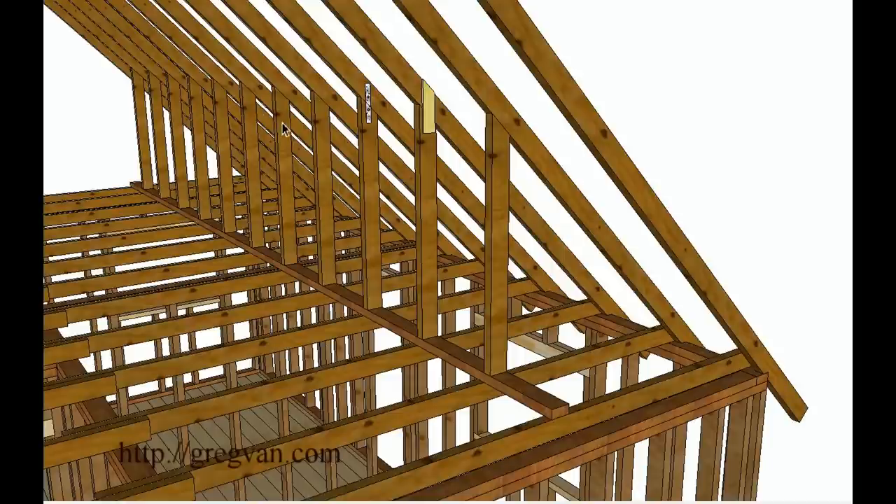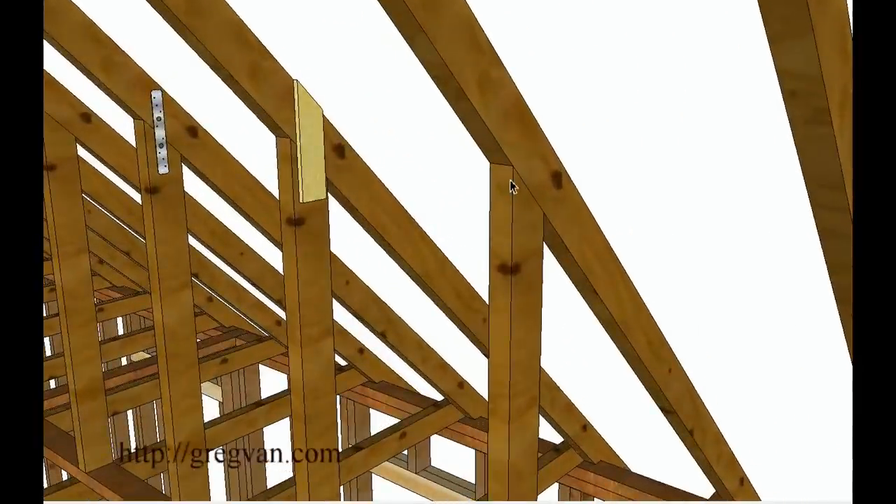This approach could make it a little easier because you're going to be able to put pressure on the rafters. These are just examples — I really don't want to go into too much detail on how to do something like this because you might not be allowed to do it anyway. You can cut the wall studs tight so they fit underneath the rafter, then use a piece of plywood with a couple of 8D nails — maybe four nails on each side. Or you can use a strap, some type of building hardware.